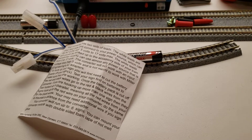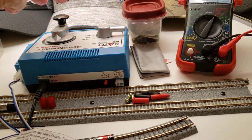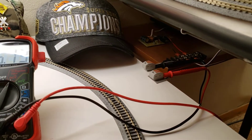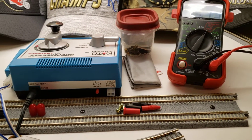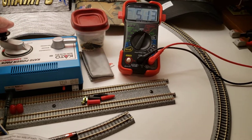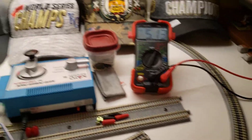So we hooked the sign up and you can do it both reverse or forward. Put her about the 12 o'clock position. At 12 o'clock, she rounds out about — as it shows right there — about 5.12 volts. That's exactly what that 4804 converter has to have. When the power's down around 4 to 4.5 volts, the sign is not really lit that good. You put her back up to about 5.12, you've got a really happy sign.